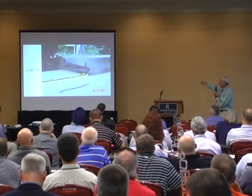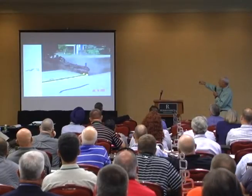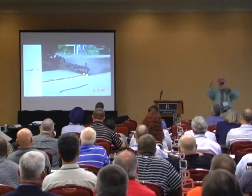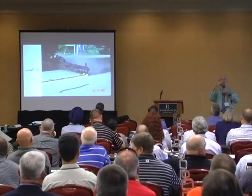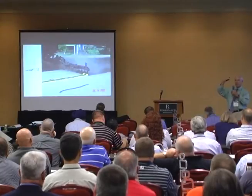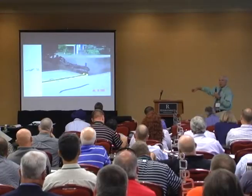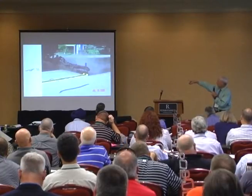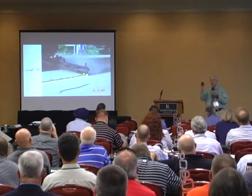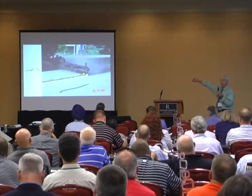That's why you see the streaking over here. Notice how all the triangles are not exactly the same — those nozzles are all cattywampus in the bar. They're not turned the same direction. They need to be 15 to 30 degrees, depending on the truck. If you look at your bar and you don't see all those triangles exactly the same, you can't get a uniform application. Don't do it this way.